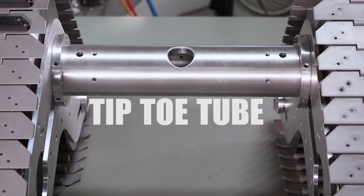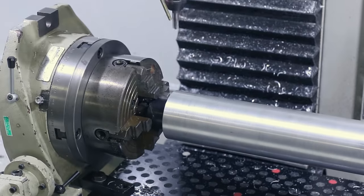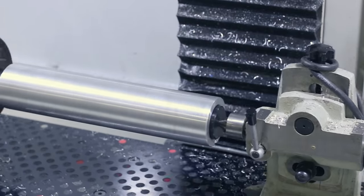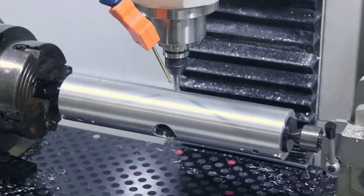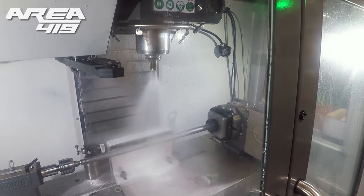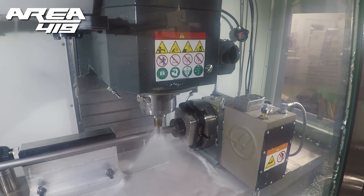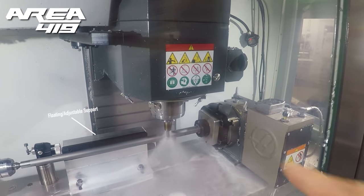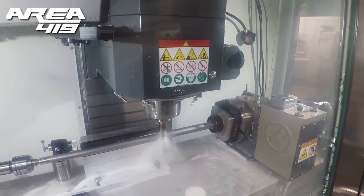The last two relate to large cylindrical work. Don't overlook the ability to use a lathe chuck or a fourth axis along with a tailstock to hold large parts, whether you need fourth-axis positional style work or just need to hold a large otherwise difficult-to-hold piece of material. In widget 248, we did this for a Johnny 5 toe tip tube. And finally, showing off how Area 419 flutes their rifle barrels — a really ingenious setup. There's a Haas rotary with a Haas tailstock, but the key is a slotted stabilization jig that floats so it can be adjusted depending on the barrel contour or taper, providing a backstop support as the barrel is being fluted.